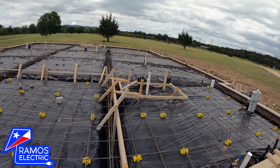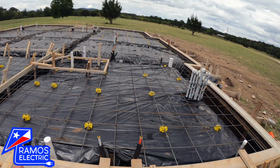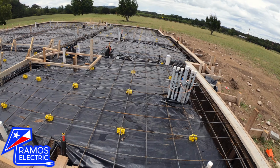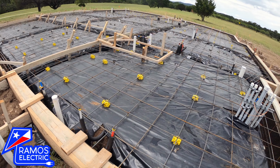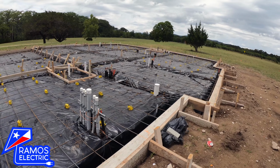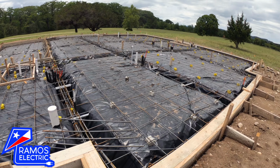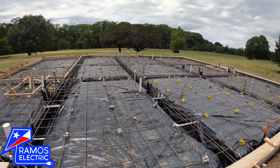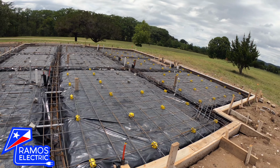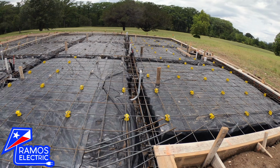Our guys just dug a little bit by hand to get it below the black plastic grade and above the plumbing, because the plumbing is a little deeper here, but not very much actually. So it's all below the concrete, and we just have stubs. So one for our island, which is typical, and then we have 3 or 4 stubs along this wall, and this foundation beam is actually representing where a load-bearing wall goes all the way down this wall.